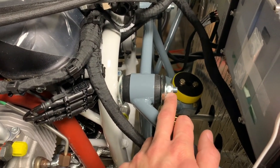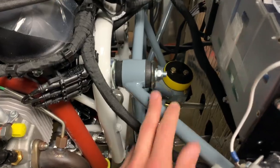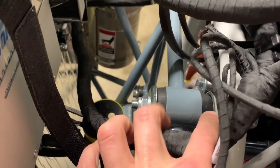I got word from the factory that these bolts need to be torqued to 38 newton meters, which is a lot of torque. The problem is down here I'm at only maybe 15 newton meters and I'm already starting to contact the exhaust — part of the exhaust in there — with that bolt. So I'm going to have to ask the factory again about that torque value, because if you torque it to 38 newton meters these components are going to be completely smashed.